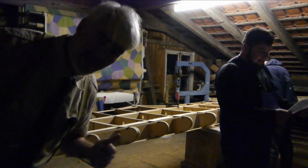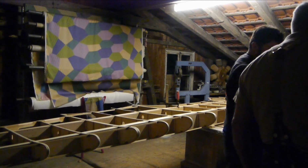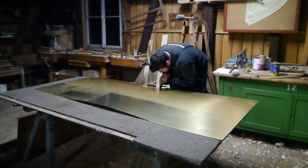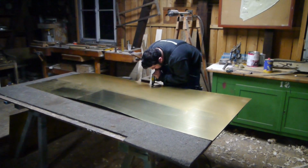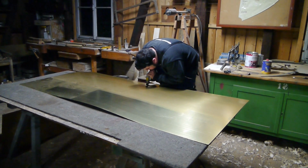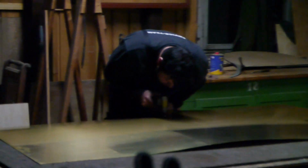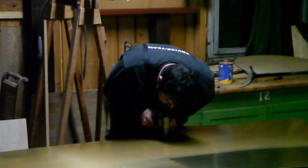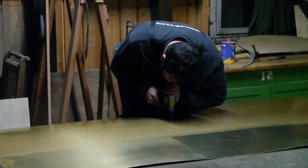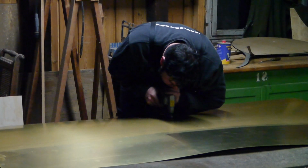We have not yet done engineering drawing for the fuel tank. That means that Matze has to go over the existing fuselage frames, has to check all the dimensions and measurements to make sure what he is building as a fuel tank eventually will fit into the fuselage frame. This is prototype development. First you build a part, make sure it fits, and then you draw up engineering drawings for further productions. And since Matze mentioned interest in learning how to create an engineering drawing, we might in a future episode of our workshop show how the fuel tank drawing is developed from start to finish, so that you have something of it too.